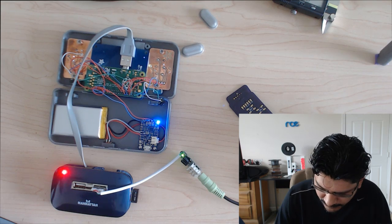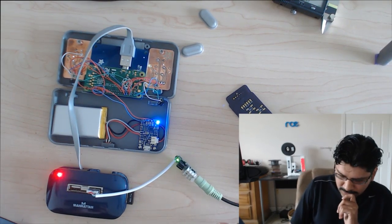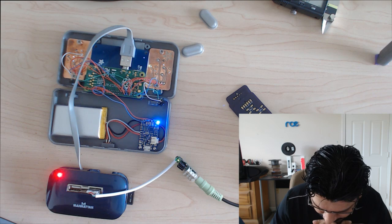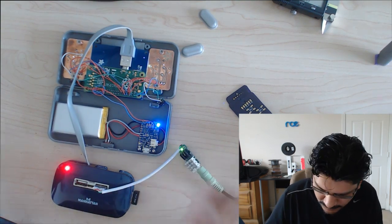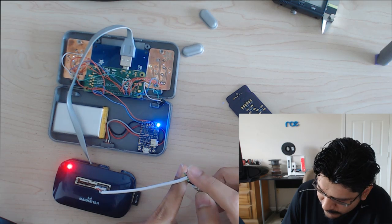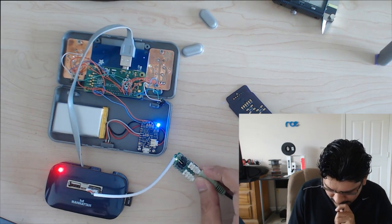And for the audio itself, there aren't any mounting holes on this thing, so it's just a square PCB with 2 audio jacks. So I'm gonna have to either have walls that keep it in place, which could be rather difficult because we got wires and stuff coming out of the back, so I have to be careful where it is. The one thing you don't want is to plug in the audio and it gets moved and then stuck inside the case, and you have to take it apart. So I have to figure out something, I guess a wall in the back here, but that's where the wires are, so it's a little hard to keep that in place. So I'm thinking either we stick it with some hot glue or mounting tape, something like that might work.